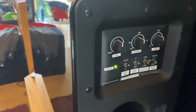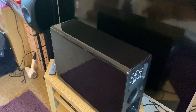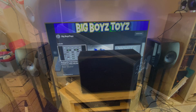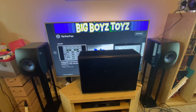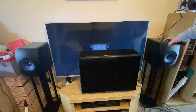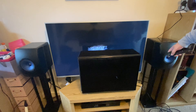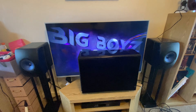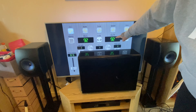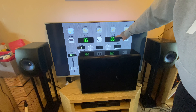One of the cool key features is that you can hide the cables away. If I take this panel off — it's quite hard to remove — you can see your two line-in connections, or you can use just the bottom one for mono. You can also daisy chain it to another subwoofer to run multiple subwoofers in your system. There are high-level inputs too, so if your amplifier doesn't have a subwoofer output, you can connect your speakers directly to it. And of course there's a voltage switch. The cables come up through the bottom of the unit.